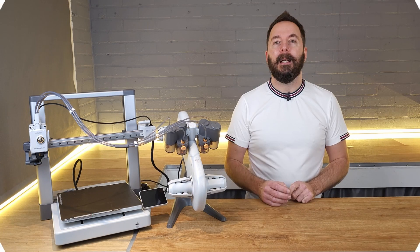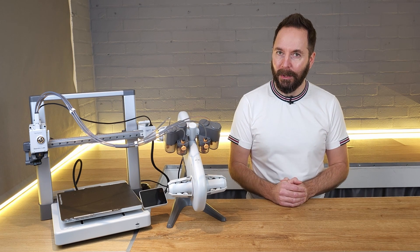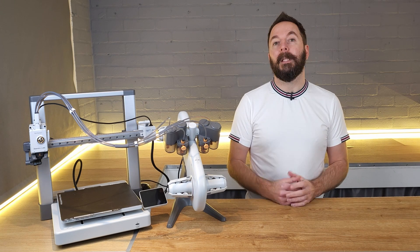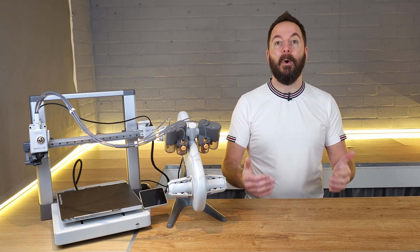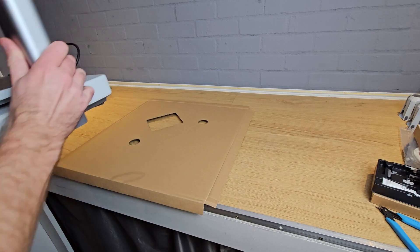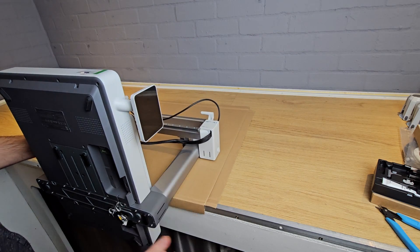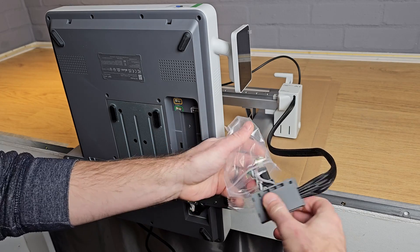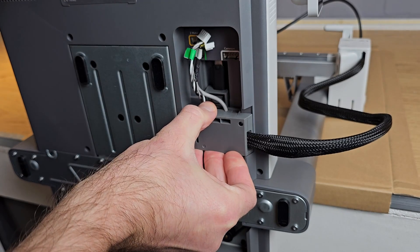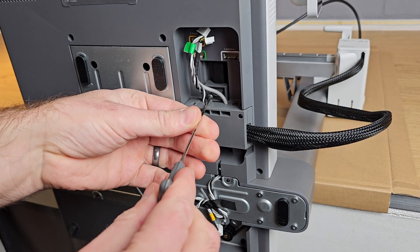Now if you haven't been working at a table or desk so far you're going to need to find one, as we need to gain access to the underside of the base without damaging any of the cables. The best way to do this is to lay the printer on its back with the base hanging off the edge of a table or desk. Before you do this, use some of the packaging to protect the printer and the surface you're laying it on. With the printer secure and in a position where it can't fall forward off the table, take the large grey cable box on the end of the wiring coming from the frame and insert it into the cutout in the base and then slide it up. Make sure that the type C plug has been inserted correctly and that the cable box is flush with the base of the printer. Screw in the pre-installed screw to hold it in place.